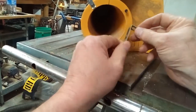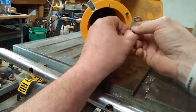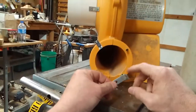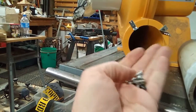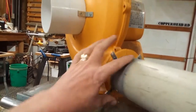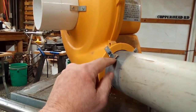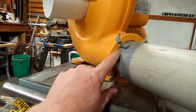See, I found this in my little box of brackets here. This will work perfect. I can slide it and make it fit. I'll just go ahead and cut it off here, or maybe even cut it off here, and I already have a hole. Doesn't have to be exactly the same. Hey, I'm not OCD. All right, I was able to pick out a few more little short stubby screws. These are thicker, bigger screws than the others. Hook that thing on there, and it'll not sit down on there, fit here, have a gap there. I'm going to probably just shove a little washer under there just so I get a tight fit, and then I'm going to seal around there with some silicone caulk.